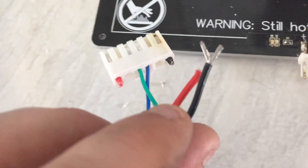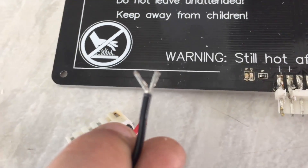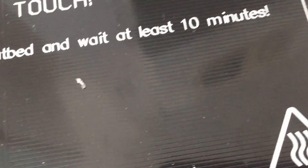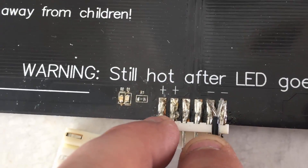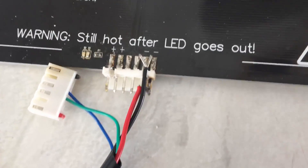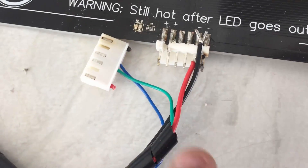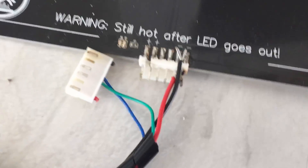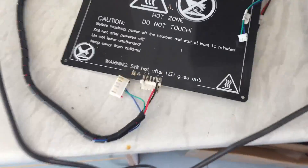What I've done is cut off my plus and negative wire, and as you can see with the negative I've split it into two. I'm going to solder them directly straight to the two blacks on there and the two reds on there. The reason why it burns out is because it's just too much power going to the bed and it can't cope with it — there's a second pin there and I don't know why they didn't utilize it.